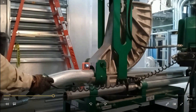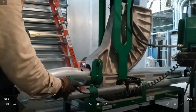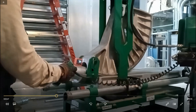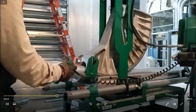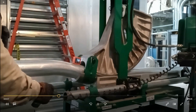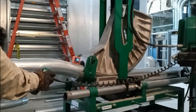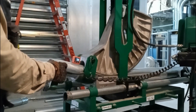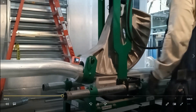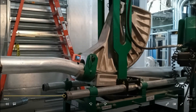I'm taking it to 12 degrees again for a 10-degree bend. After that, your offset is complete. I'm bending short offsets so I'm just using one pipe — I'm gonna bend two offsets on one pipe and end up cutting it, because I only needed a 50-inch length of pipe with a three-inch offset on it. I needed four of them, so I'm bending two offsets on a pipe.